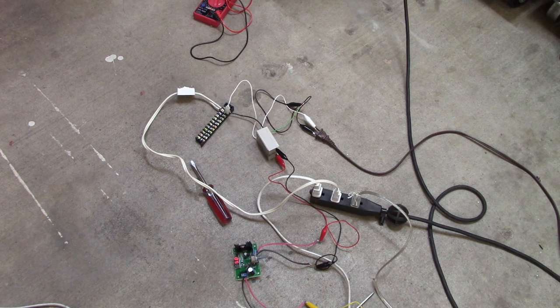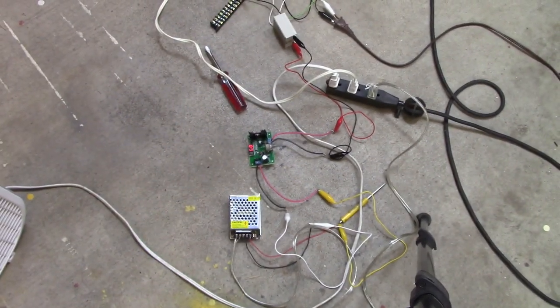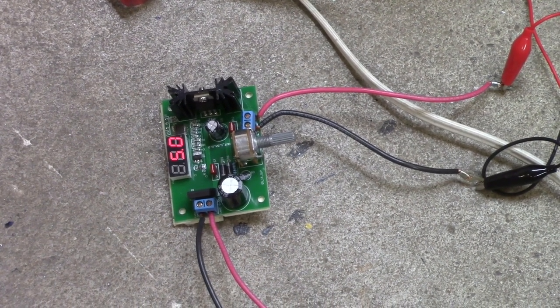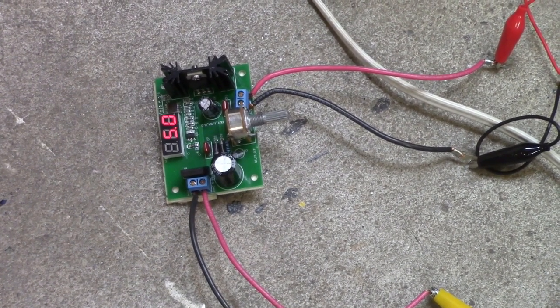I've got, as you can see there, a little power supply with a voltage regulator, and that voltage regulator is putting out 5 volt DC to trigger the thing, and the smart valve will either give it 5 volts DC or 10 volts, one or the other. Very low amperage, of course, but enough to trigger the thing.